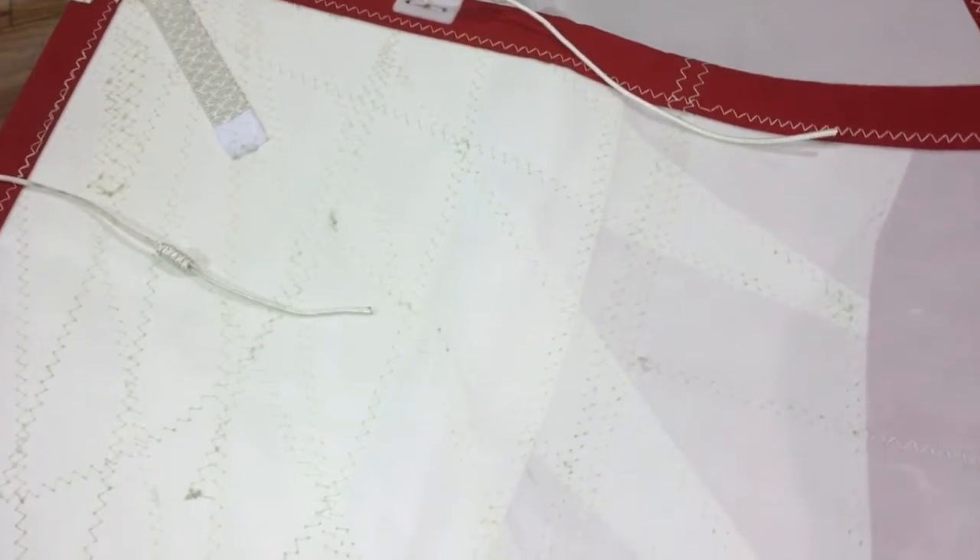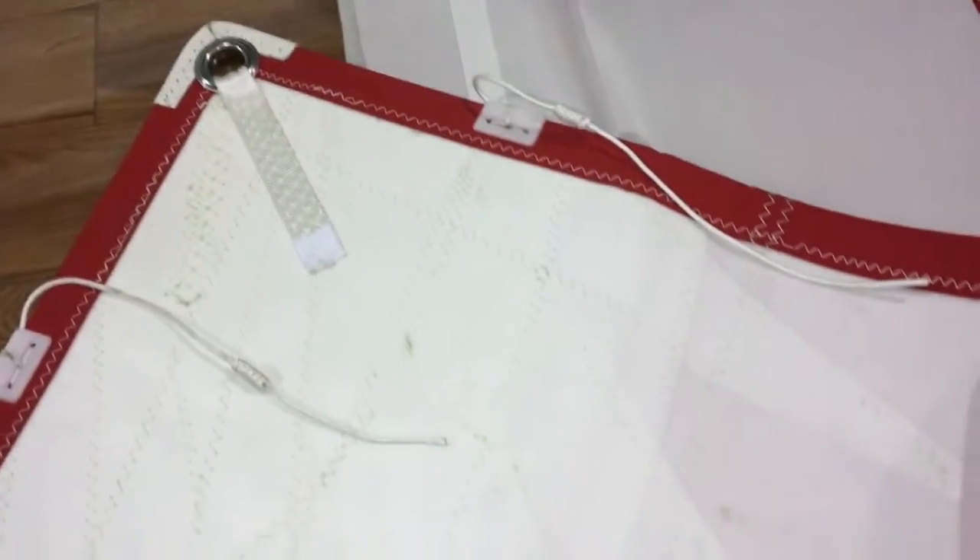Let's flip it over so we can take a look at the radial corner. Our radial corners are both block corner and radial, so that we don't have any issues with cutting from those radial corners when they come out. Here you can really see where the radial is on top of the block on the outside. That is the way to do radial corners — you should not be just doing radials without a block underneath it.